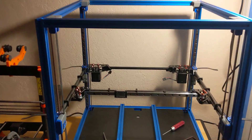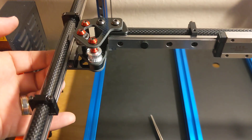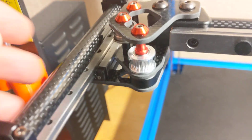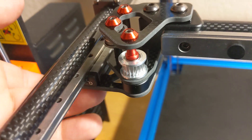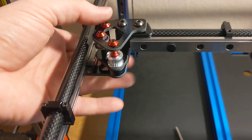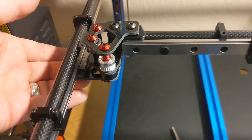That was a lot of work, more than I thought. Today I got the bolts. This part of the gantry, the x-axis, is held to the linear rail carriages — you can see right there — by four M3x5 bolts that, according to the Chaotic Lab kit, were supposed to be included, but they were not. So I ordered some online because I can't find M3x5 locally.